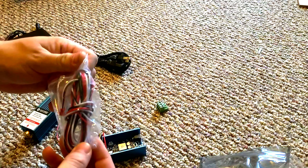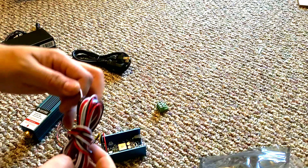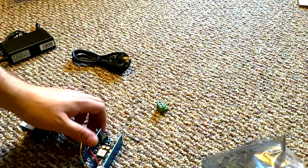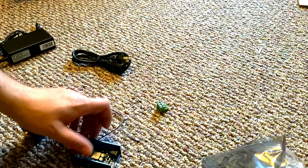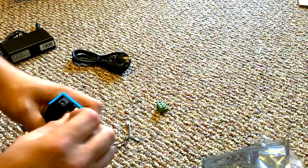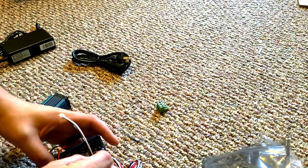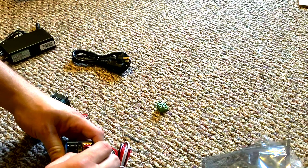This is what comes with the Prover — the little thing that plugs into the control box, and the wiring, which is very long and plugs right into the little control board, so that worked out easily. I lined up the wires to match the way they came out of the adapter, using the keying of the plastic part as my reference for top orientation, same with the one going into the 4030 controller. It worked out. Unfortunately the offline controller's PWM button didn't turn the laser on.